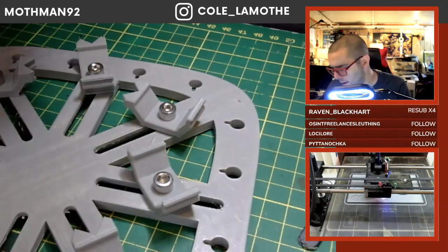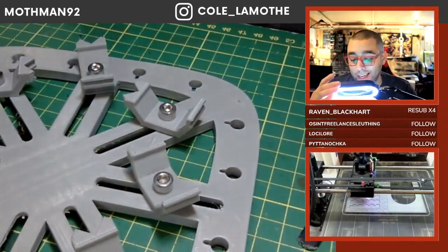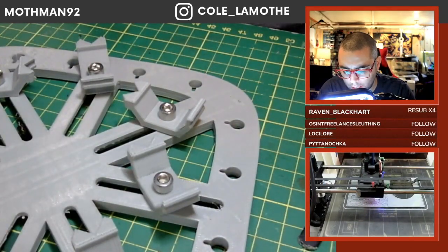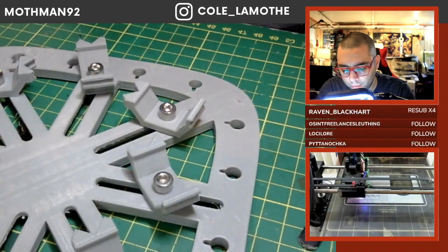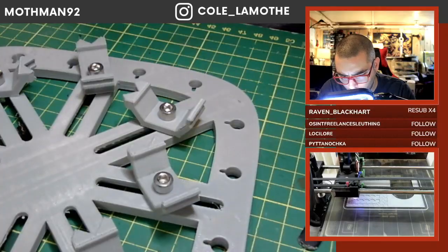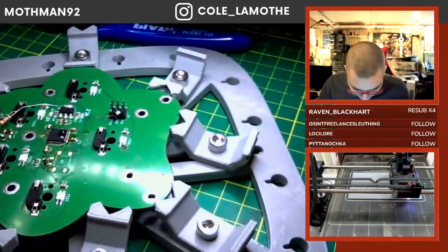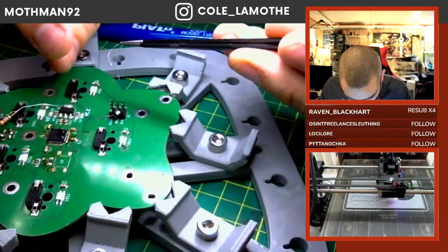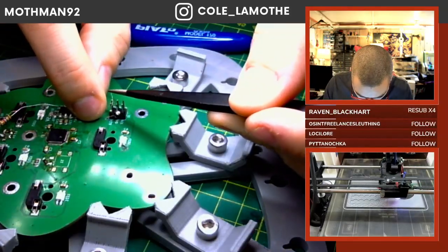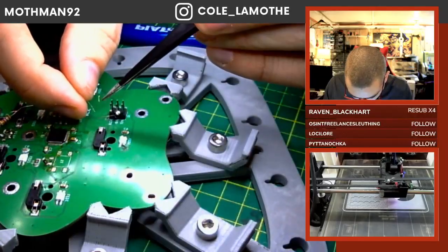Set pin — something short there. The next likely candidate is that the chip itself is holding it under reset because of some error state. It's about 40 gauge wire, if I remember correctly. Silly, silly thin. And using it without magnification is possible, but it's difficult.